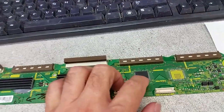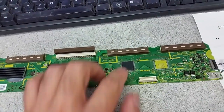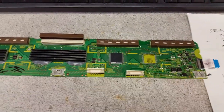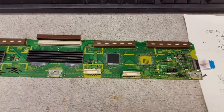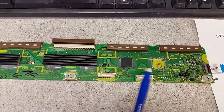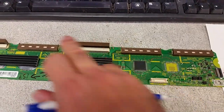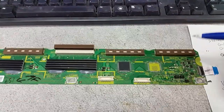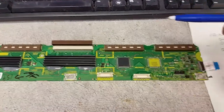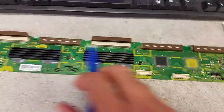And what those guys do, the ICs here, they're shift registers with very powerful output switch transistors, and they're being filled as shift registers with information that is basically Boolean 0 or 1, binary. And that determines whether the output voltage goes out or not. The output voltage is supplied through the connector. So the system actually has two sets of voltages. One is the output voltage that has to be showing up on each one of those pins. Depending on whether the pin is enabled or not, it should either show up or not show up so many times per second. And then there is the low voltage needed for the logic that operates all those ICs that are on the buffer board.